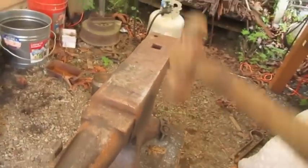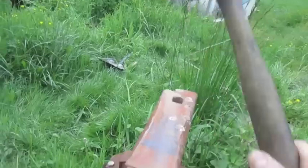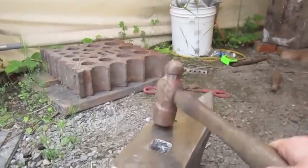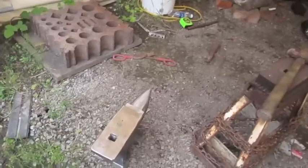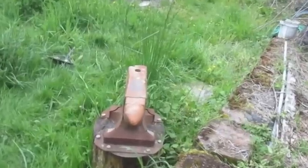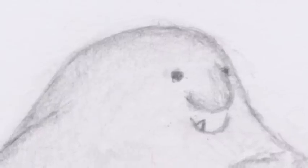If you're wondering how the ring compares to the other anvils — there's my Hay-Budden, wrought iron base, steel face. My Fisher, cast iron base — good rebound but very little to no ring. Same with this one — a little more ring. And this one that I modified — it's got some ring to it. Once again, it was a lot of fun to do. It looks really nice and it's a great project for anyone wanting to add to their anvil collection. I have plans for this one. Hope you enjoyed — do subscribe. Hope you found this video entertaining and possibly a little bit educational.